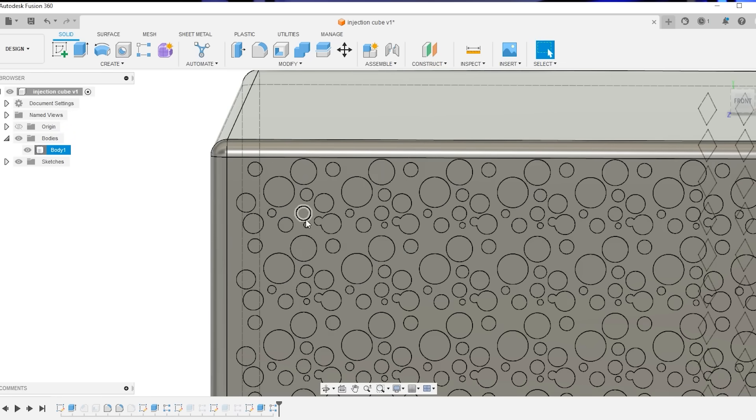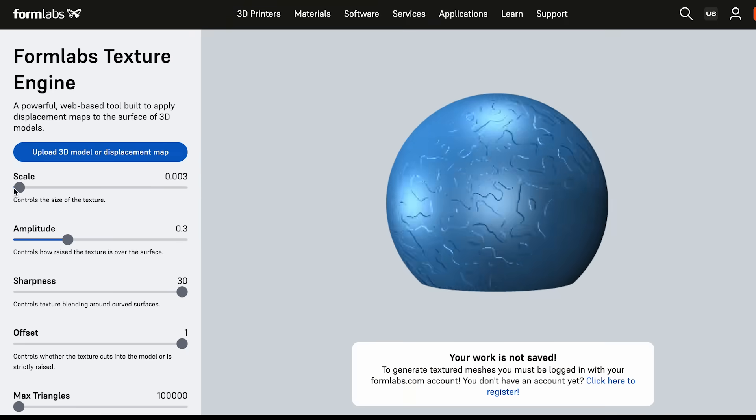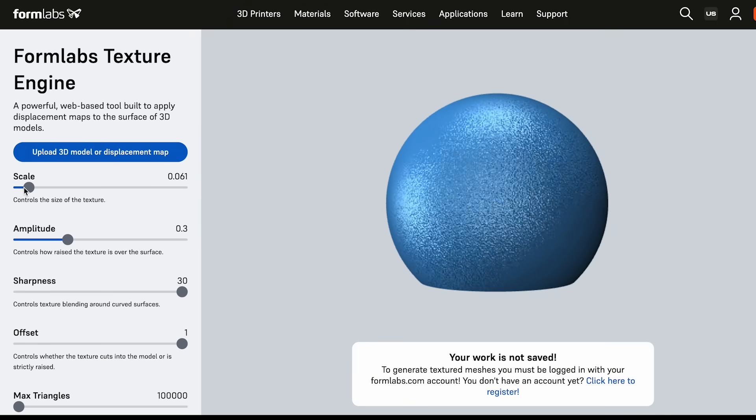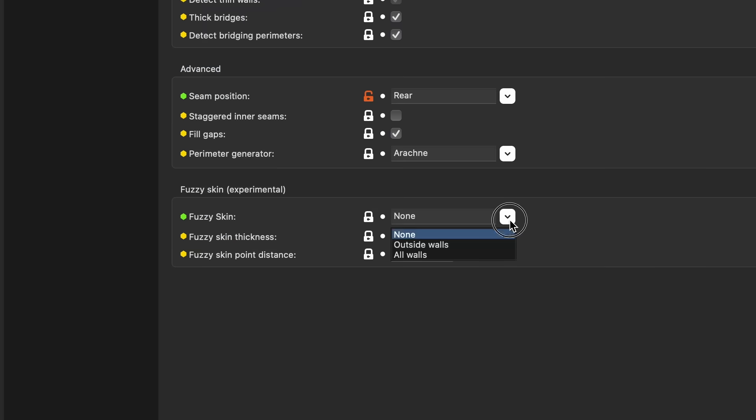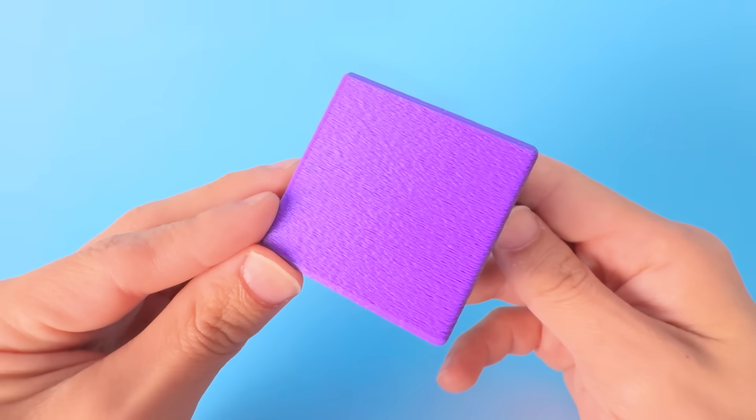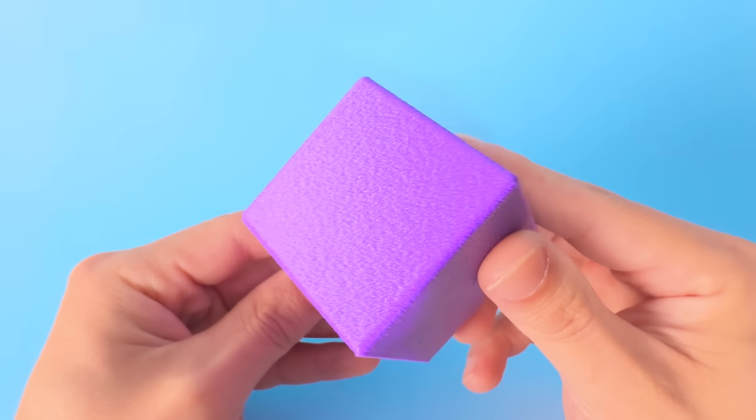There are multiple different ways of adding textures. You can do it in CAD by replicating the pattern over and over. You can use external tools like Formlabs Texture Engine to upload a negative map and it will create a texture. You can also use internal slicer settings when available to create fuzzy skin to break up the surface. All of these are excellent options to take a terrible part to a really nice, beautiful looking part.